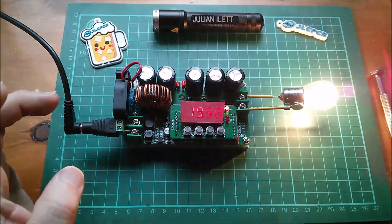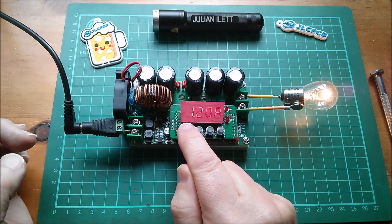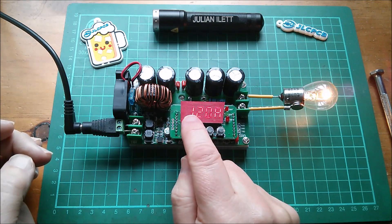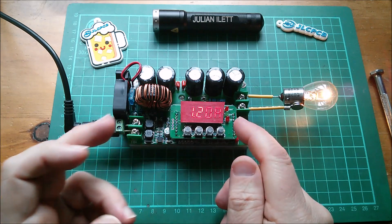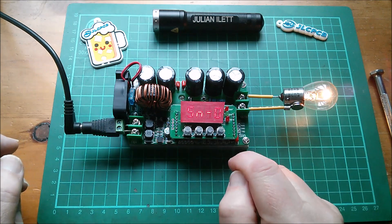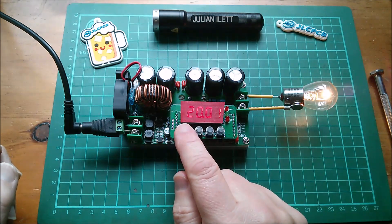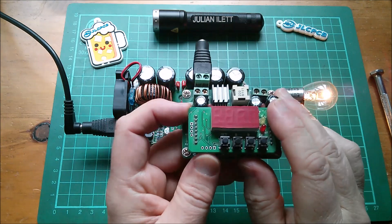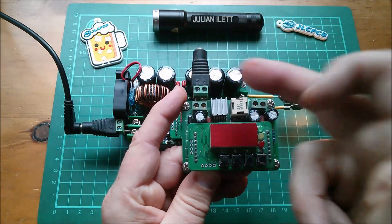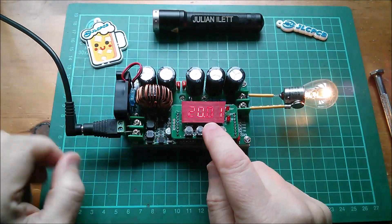The other thing that makes me think this is from the same stable as the buck converter is that if I turn it off, off isn't really off. Pressing this button shows you the current and voltage. Now if I change the voltage slightly to 20.01, you don't get a row of four dashes to indicate it's saved. What you have to do is press and hold — you get F0, which is Save — press Enter, and it saves to number zero. Note that pressing and holding the Set key, as on Ming He devices, is dodgy because it takes you into the calibration menus, and it's very easy to get a calibration voltage on the output — which could be catastrophic, as I think on this one it's 30 volts.